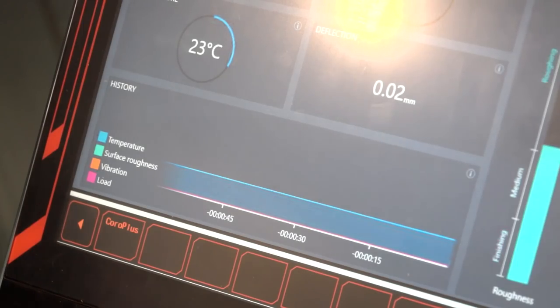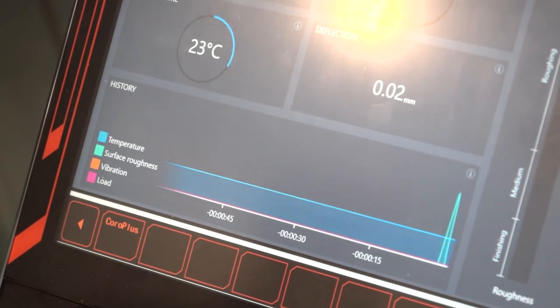What else does the data tell us? Will it give us an indication of surface finish and things like this? Yes, I think by the record you get from the process you can get a good picture about the surface quality, and you can also play with the settings so we can optimize your cutting feed, speed, and the process parameters. This is on a huge boring bar.